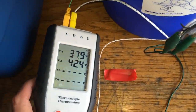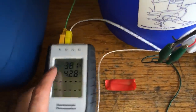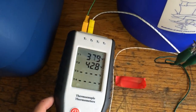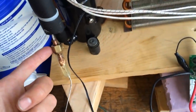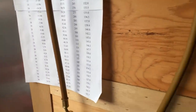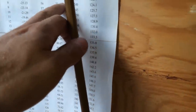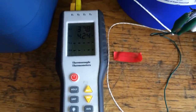Just to give an idea of what's going on here — the first number there is the temperature of the water: 38 degrees Fahrenheit. Started at about 64 degrees Fahrenheit roughly 20 minutes ago. The second number there is 43 degrees — that's the suction line thermocouple. It corresponds to about 55 PSI gauge, working with propane, which corresponds to about 33 degrees Fahrenheit saturation temperature. So that's probably roughly 10 degrees of superheat.